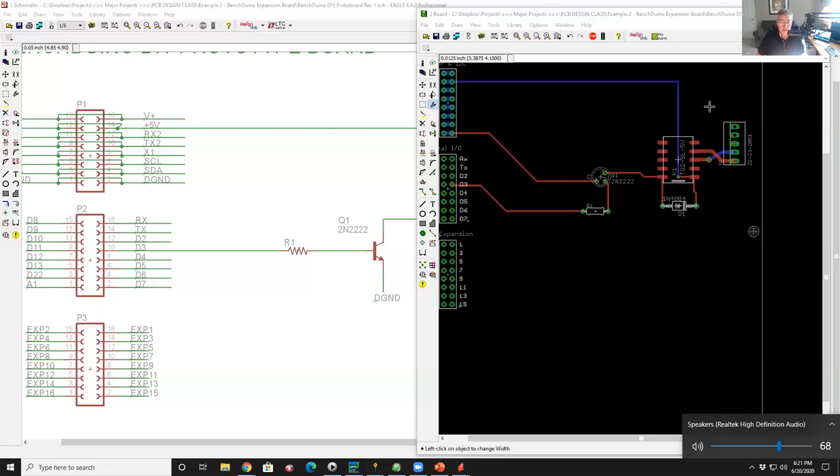Okay. Now, was there any reason that you wouldn't put some pins on top of the daughter board? So if you wanted access to additional pins? You could do that. I think that would be a good idea. So what we wind up with is 1, 2, 3, 4, 5, 6, 7, 8, 64 pins. So there are 64 pins of interconnect, and a few of them are doubled up like power and ground, but mostly there are 64 signal pins. If you look at something like the 18F8722 PICs, which I've used in our repeater controller projects, that's an 80-pin QFP. Now, granted, there's many power and ground pins, but there's more pins on that part than you could put on a 64-pin daughter card. Sure. So if I were really going to do it right, I probably should have put another header on there. That would be a reasonable thing to do.